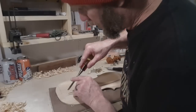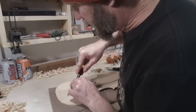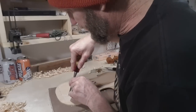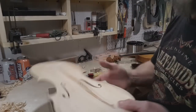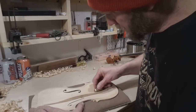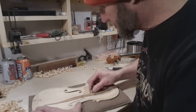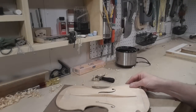Very carefully use your small chisel, very carefully. And you're kind of putting, let's say, a 50 degree angle on the end of this. Taper it down to nothing. Just don't stab it into your plate. Now let's use our little thumb plane again. Go along the side, on both sides, and let's start to round this top over for now. Here's a good preliminary shape. Now we'll check it on the computer.